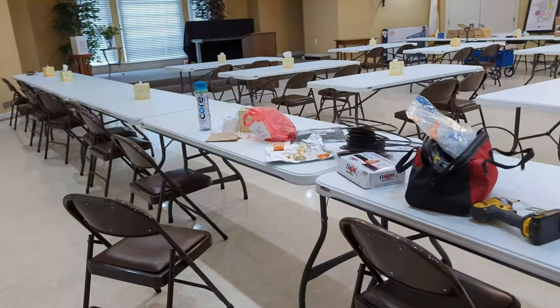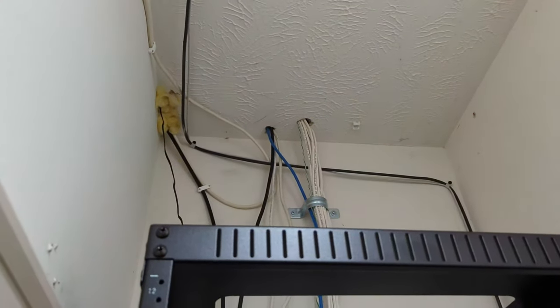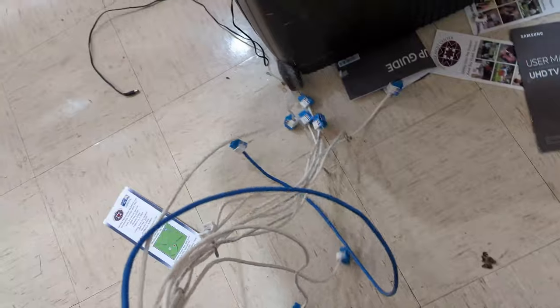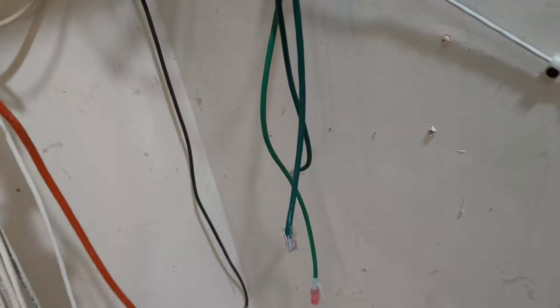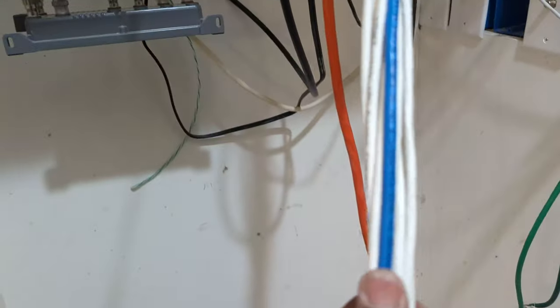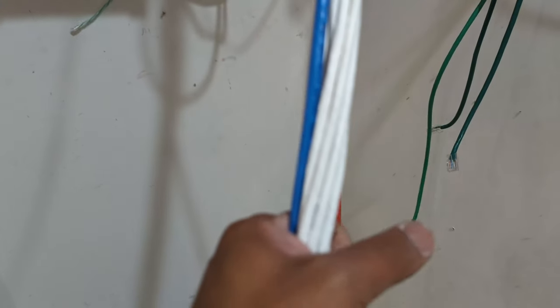There was a humongous spool of coax here I thought I could repurpose, but that's RG59 — not going to work for what I'm doing. We cleaned all that up and we've got a whole lot of extra cable, so I'm going to repurpose those keystones I did and cut all this cable to about right here, since all the extra isn't needed. It's still going to be a little wrapped but more than enough, so let's repurpose all these keystones and make a whole bunch of terminations.